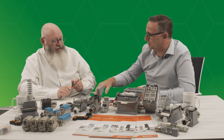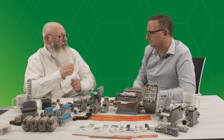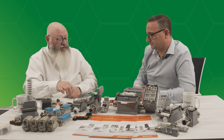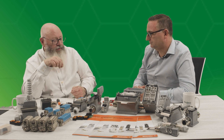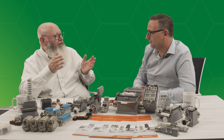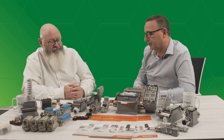And that's now reset to accept the wire again. I think we were talking earlier — it's that engineering click, isn't it? It is absolutely. It's that confirmation that it's definitely seated and you can move along. By not needing a ferrule, the time saving is huge — you've got the cost saving of not needing a ferrule, the time saving of fitting the ferrule, and then the insertion and screw or tension clamp. It's probably around an 80% saving on the standard screw method, so put that on a few connectors side by side and you're saving a lot of time, effort, and money.